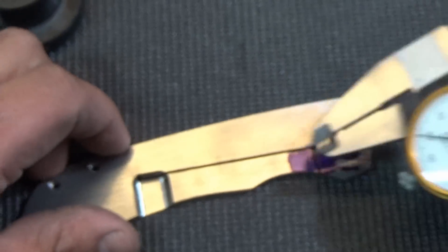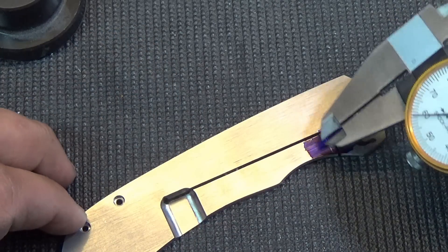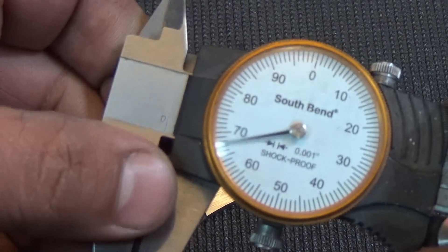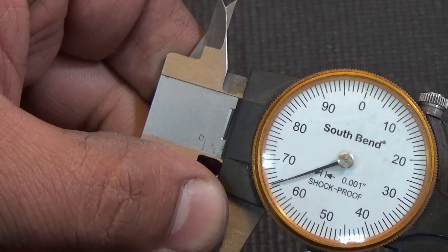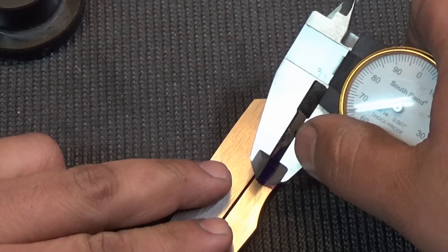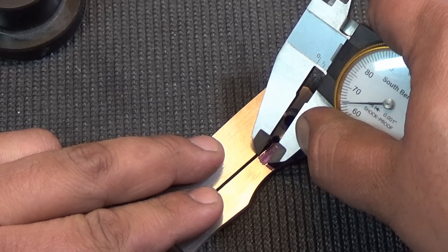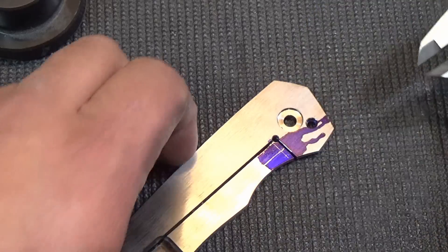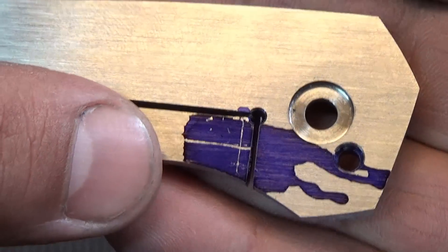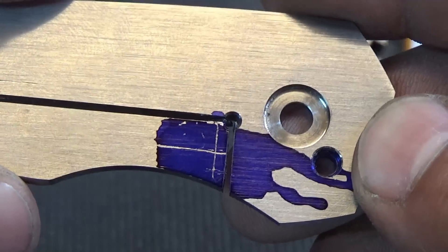In this particular design I want it right in the middle, so whatever half of this distance is — is where I'm going to measure. I measured it before going on camera so I know it's 165 thou. So there's our 165, and I'll go from the top here where I have a flat surface to reference and scribe another line. Now you can see you have a nice crosshair, if you will, to place our detent.